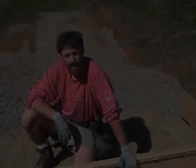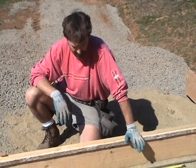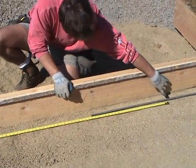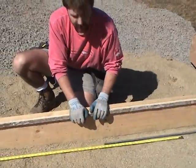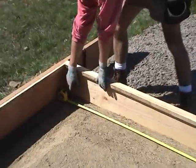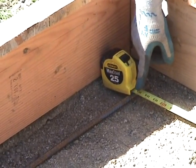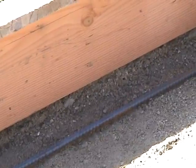When we measure for our next piece of rebar, we need to be aware that we'll have to have a lap from the end of our last piece back over with our new piece so we can tie these two together. I'm using about a two-foot lap here. As we come along, we can measure down to the other side where we need to place our bend — in this situation it's 115 inches. I'll need to remember to add two feet onto that after the bend to connect it to the other piece of rebar already in place.